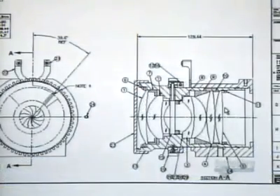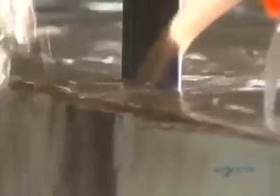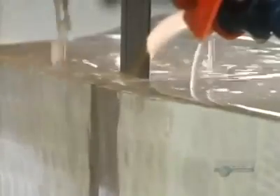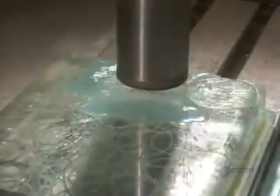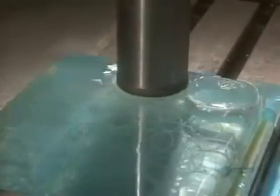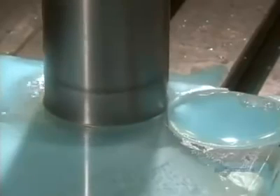These television lenses start with a very precise design. A diamond blade slices up a block of specially selected optical glass, while coolant prevents the blade from burning it. The slices then go under a diamond drill, which cuts several puck-sized discs from one glass slice. The operator is careful to keep waste to a minimum. Optical glass costs up to $1,000 per kilogram.